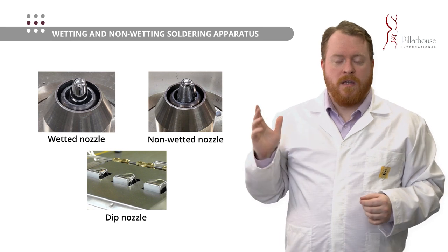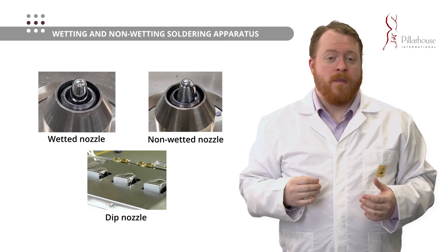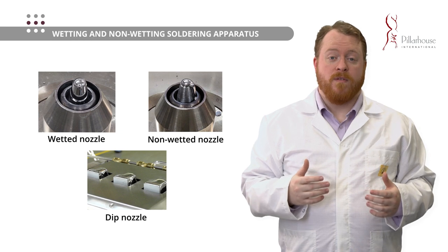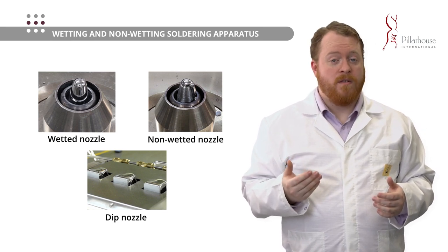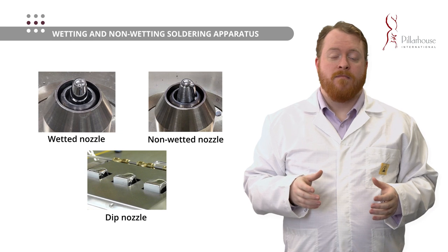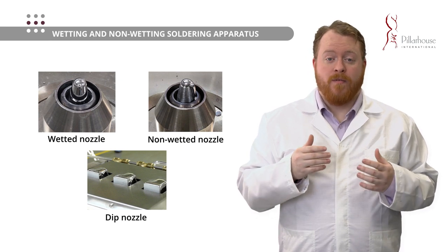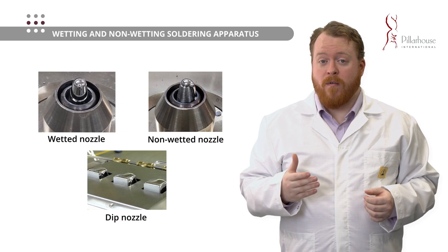Let's take a look at some of these selective soldering apparatus. With a wetted solder nozzle we can see that radial wave I spoke about earlier — it has wetting all around the circumference of the nozzle giving a nice dome shape for the solder. This is great for control, allowing us to move in both dips to an individual pin or a close array of pins, or draw step along a row of pins. If one of these nozzles does not wet well, the solder will form a single stream, where the surface energy of the solid is not enough to overcome the surface tension of the solder — which is very poor for control.